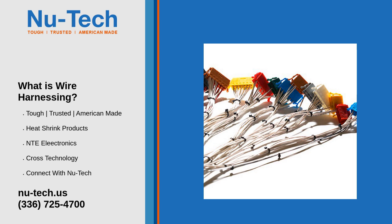Wire harness design and pre-production. A wire harness process is designed based on the geometric and electrical requirements of the equipment it is to be installed in. Once the initial design is established, a schematic is used to create the manufacturing paperwork and the assembly board for the harness. The assembly board, also called a pin board, is a full-size diagram of the harness which shows all of the components and their locations, and also serves as the workbench for the harness.